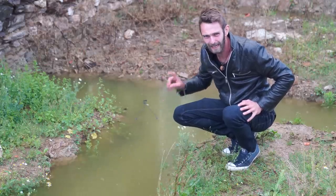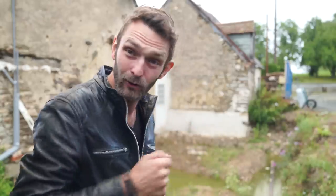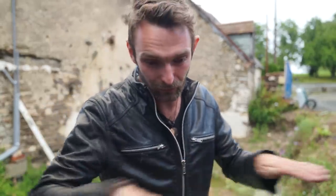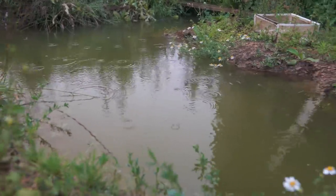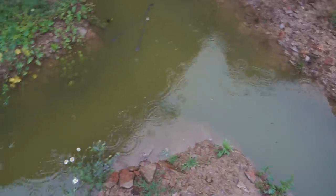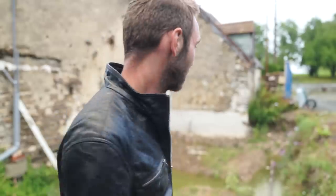I'm actually a little bit glad, because water doesn't lie — it's creating its own level. So what I can do now is go around and knock some pegs in to the top of the water line, and then when the concrete comes in, I know the top of the pegs are level. It's a bit of a blessing in disguise. Hopefully after a week of sun, it'll start evaporating, or I'll just start pumping it out so we can get that concrete in.